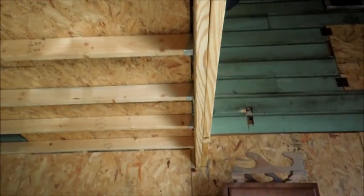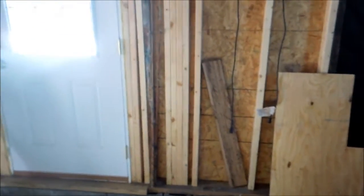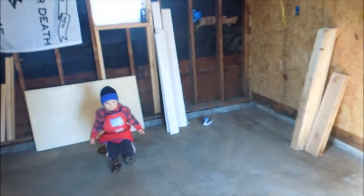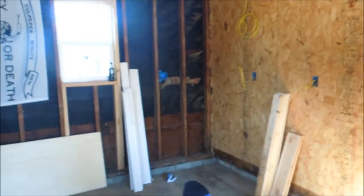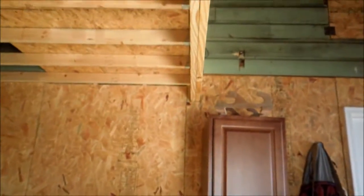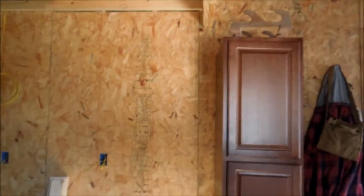beam here. So the wall will go all the way to the floor here, and then come across, come down the other side. And I've got a door that I salvaged from Wisconsin on a job where we changed out an entry door, so it's a steel door that went into somebody's house, and we're gonna use that here. It's actually for a 2x6 frame wall, and we're gonna do 2x4, so it might look a little funny, but we'll frame it out and make it look neat.